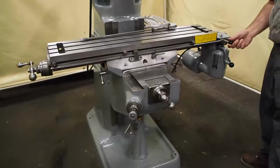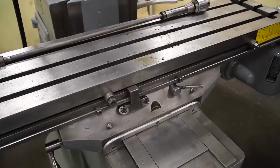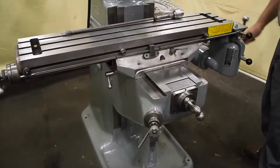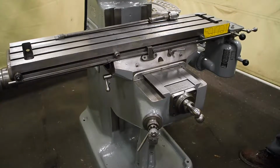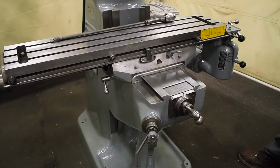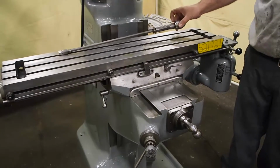And then to put this unit in neutral, just put the lever in neutral. When it does come over to the stop dogs, you set your stops right here, and this is when it knocks off the feed unit. We're going to move the table over this way a little bit so I can demonstrate. Table's going to come up to it. It's going to push the rod over, which moves the shifter back into neutral. See? This unit also comes, of course, with the draw rod. This also comes with the drill chuck too.